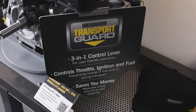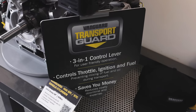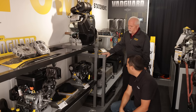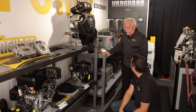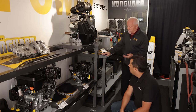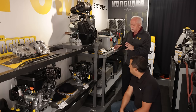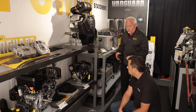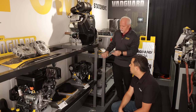So the transport guard here is something I haven't heard of before. Give me a quick rundown on that. When I move this over to stop, what is happening? It's a one-time switch that's shutting off three of your critical systems. It's shutting down your throttle — which is something that's key to do with an engine because if you don't shut it down right, it leaves gas and it starts funny. But it's shutting down your throttle, your ignition, and your fuel. Basically it's containing your fuel and your oil into where they're supposed to be, so they're not bouncing around. As you're transporting the machine — obviously called transport guard — so that they're not mixing and they're not fouling your engine.